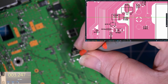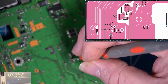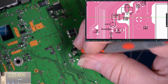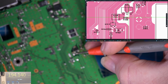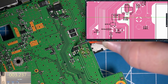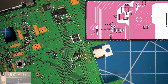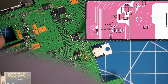What do we have here? Nothing. That's 7 volts. Okay. So that being said, it's made no change at our Q1511 point. We've eliminated the Q1512 out of the circuit. So let's replace Q1511 because I do happen to have those on hand. I do not have the other one on hand, so hopefully that's all it takes.